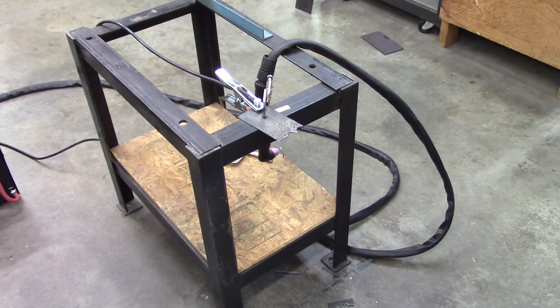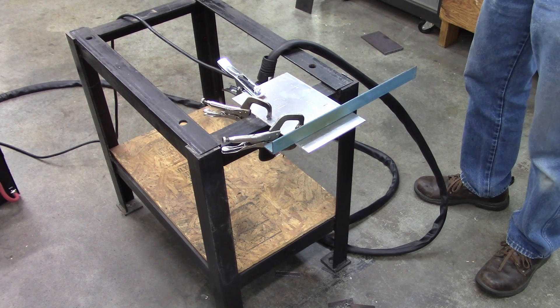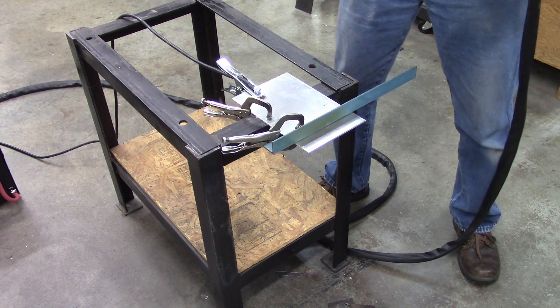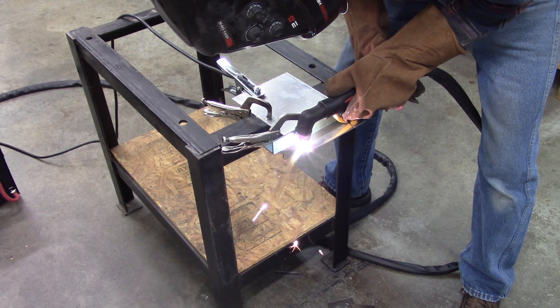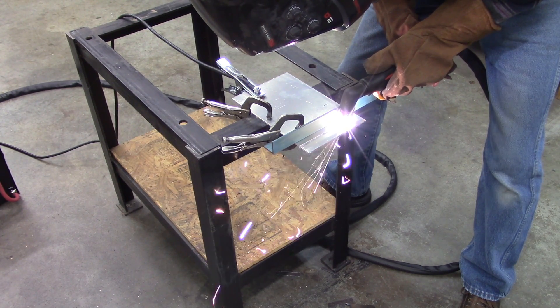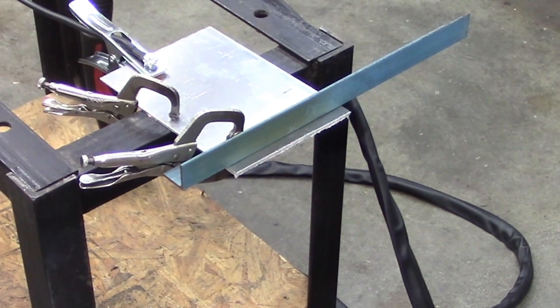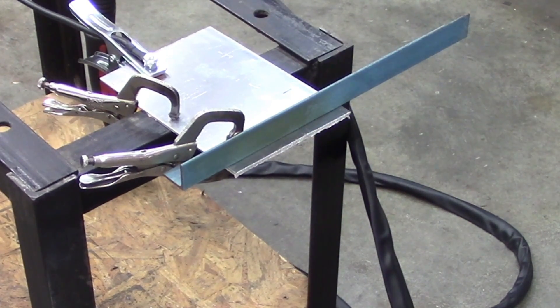Like I said, I can't make a straight line — I was just goofing around there. Let's try some aluminum. I've never tried cutting aluminum with a torch or a plasma cutter, but it's supposed to work good. I should probably read the instructions because I don't have any idea on aluminum amperage — we're just going to try 30 amps right where it was. This is eighth-inch aluminum. If it doesn't work we'll try something else. That worked fantastic — not super smooth but it's pretty good, probably a little smoother than steel. If you do a lot of fabricating with aluminum or steel, this is really the trick.